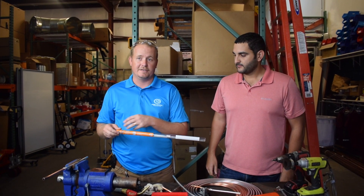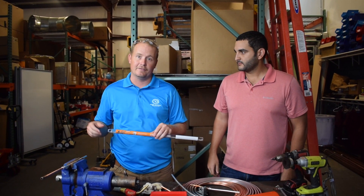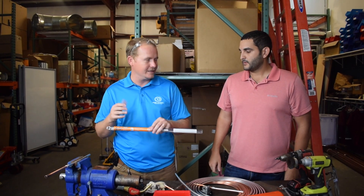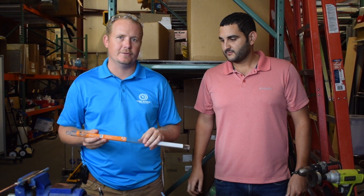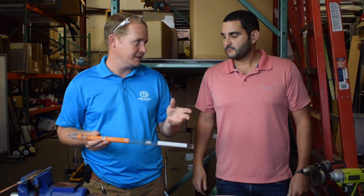When you have copper that's near aluminum, aluminum starts to disappear on you at about 1200 degrees. A lot of the copper rods start to flow at about 1200 degrees, so that's incompatible. This Alcop rod flows around 950 to 1000 degrees Fahrenheit, right in there. So it's in the safe zone for aluminum and obviously for copper.